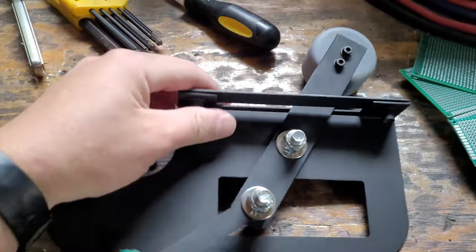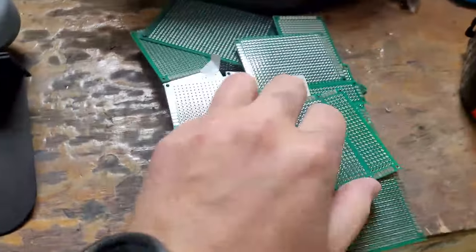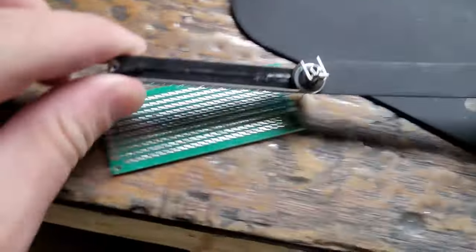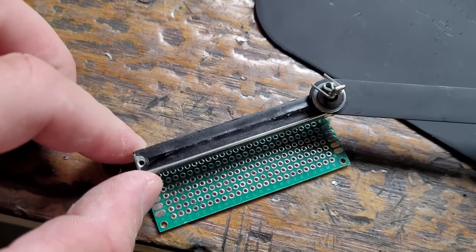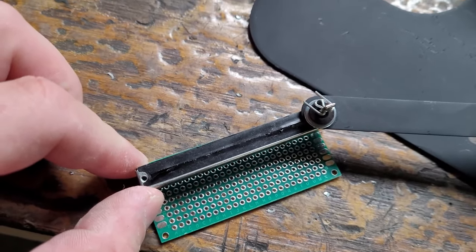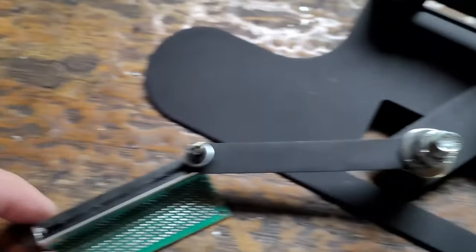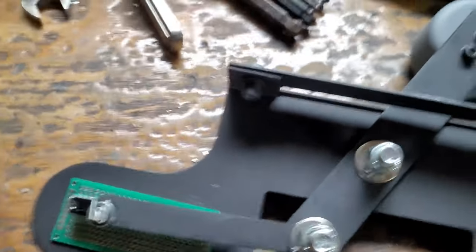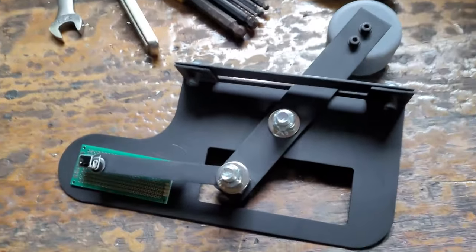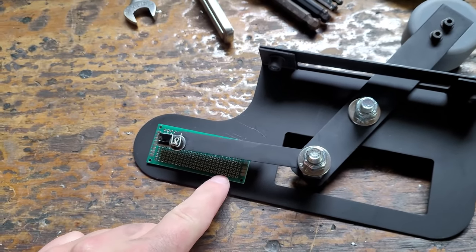We've got our throttle assembly mostly put together. Had to wait for some of these breadboards to come in. Gonna have to mount, there's a little linear potentiometer here that's going to supply our 0 to 10 volt signal to the fuel pump brushless motor to control the output of that fuel pump. So I'll have to mount that on this board just inside of here. So we'll do that today as well. That way when you move this lever forward and back, it changes the output voltage of that LVDT. So pretty basic stuff.